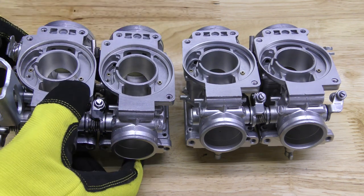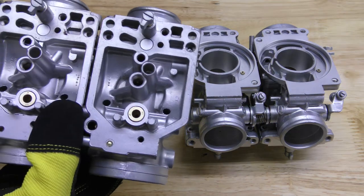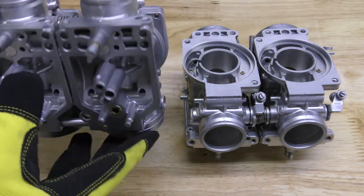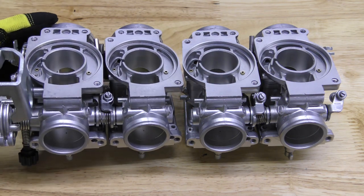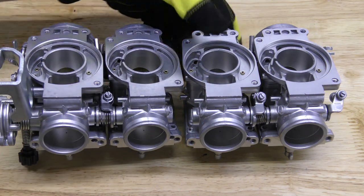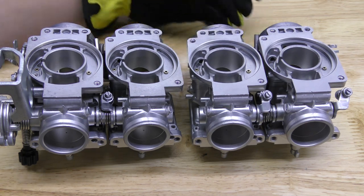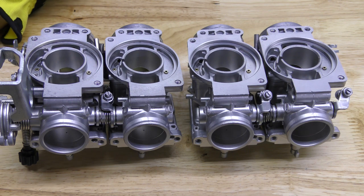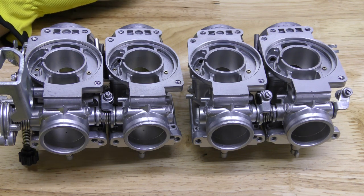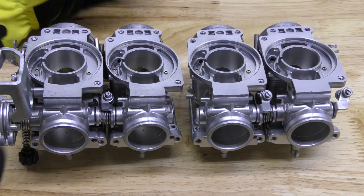You want to get these parts dry — zero moisture left behind on the part. These parts are exceptionally clean and dry, and that's the biggest key. Obviously if you have ferrous metals and you leave moisture on them, they're going to rust. Even with rust inhibitors, a lot of times you have issues, and that's why people in high humidity areas have issues with flash rusting even using rust inhibitors.